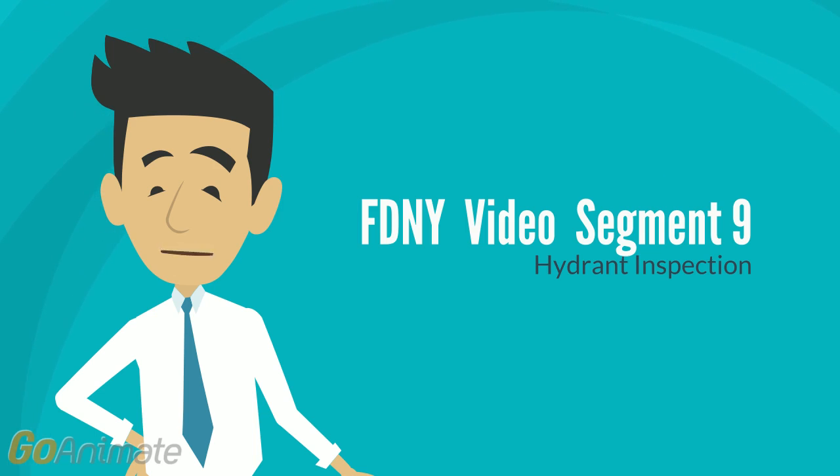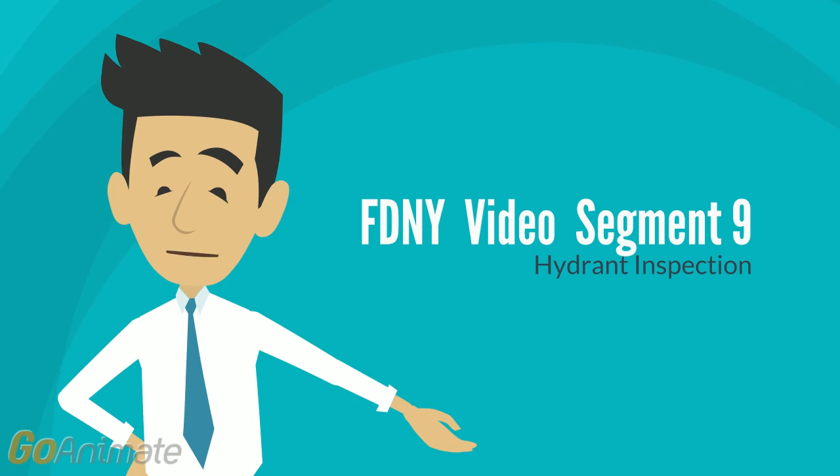E. Close the hydrant slowly — one turn every one-plus seconds — so that the hydrant does not close too quickly and create a water hammer that could possibly blow a water main. F. When hydrant is closed, you should be able to back off the operating nut a quarter to half turn. Find the sweet spot — the water pressure that should hold the hydrant valve shut. G. Place hand over nozzle and feel suction.